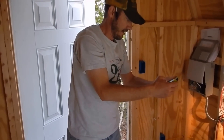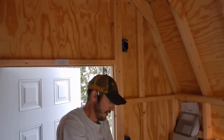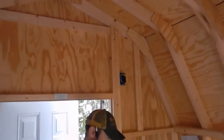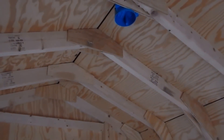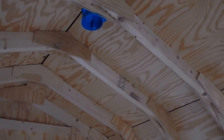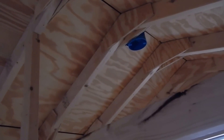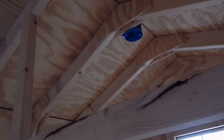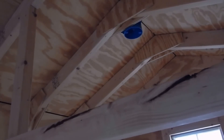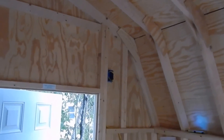Had to break out the underwater camera because it's raining outside right now — didn't want the good camcorder to get wet. That's where the air conditioner can go right there — a plug for the air conditioner. Up here are lights, one light in the center — probably a chandelier or ceiling fan, who knows. Then we have one above the loft, and we're going to have pull strings so whoever's up there sleeping can turn the light off.